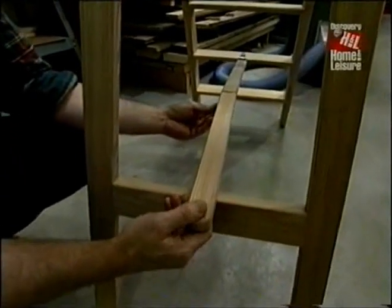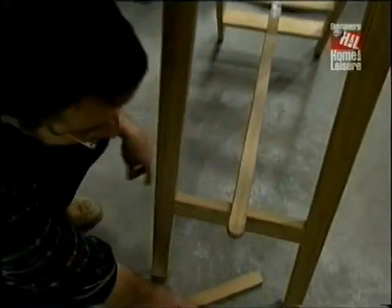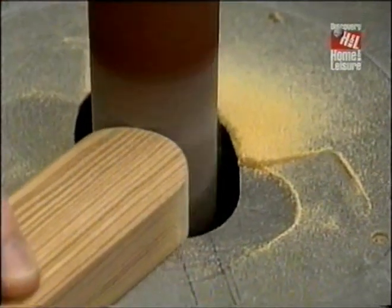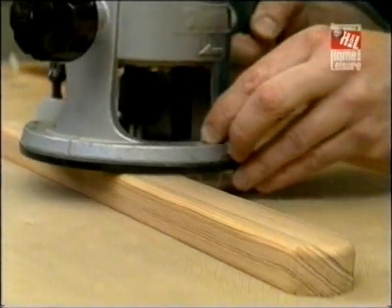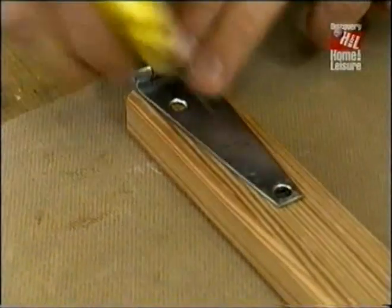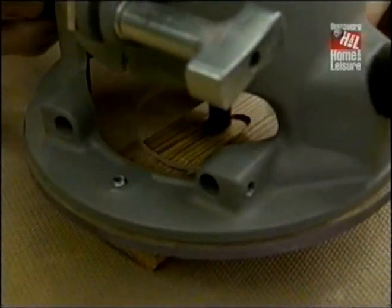The spreader is next — it's made up of two pieces. There's a hinge mortised into the step and this end of the spreader. There's a surface-mounted hinge underneath, and there's another hinge mortised into the rail and set on the bottom of the spreader. This end of the spreader is rounded over — we'll do that at the bandsaw. To round over the edges, I'm just using a portion of a quarter inch rounding over bit. With the hinge temporarily secured with a screw, I'm now going to use a sharp utility knife to score the outline. Now, freehand with a router and a straight cutting bit, I should be able to clean out most of it. I'll finish it up with a chisel.